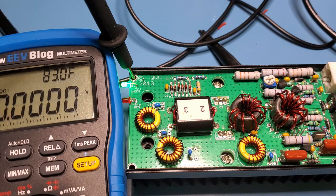I had a bad 5-volt regulator in there. The old one was acting basically as a short, so it was applying 11 volts of bias — that certainly would have caused problems. But I never adjusted the bias pot that high, so I never noticed. Interesting — I found a problem without even knowing it.